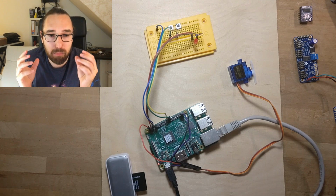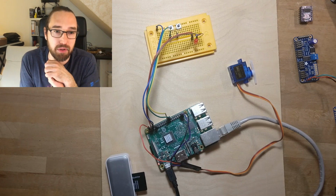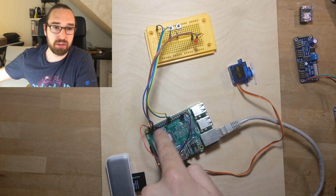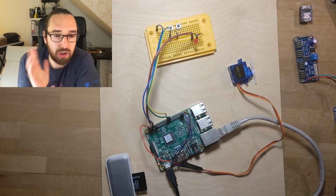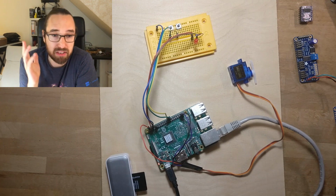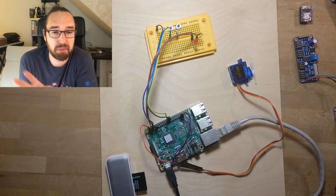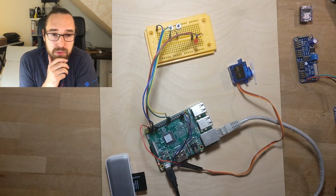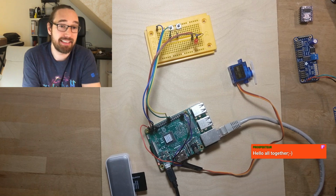And we're not going to run MPF on this Pi today. We're just using this Pi as a port extender. The reason for that is simply that the Raspberry Pi has a lot of IOs here. I think it's 40 header pins, and we can use almost all of them as IOs, and they are pretty fast. They can be updated at, I don't know, 1 kilohertz, now I guess even up to 100 megahertz or something. So really, really fast. Even compared to almost any pinball control system, those are really fast inputs and outputs, which you do not necessarily need, but that's there.